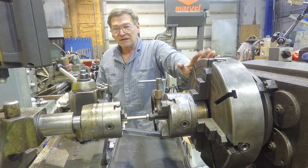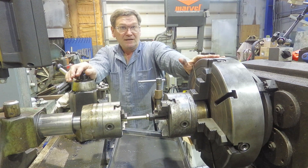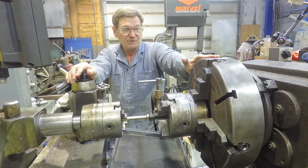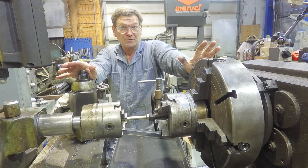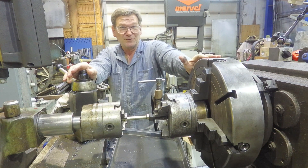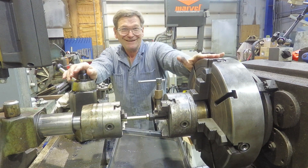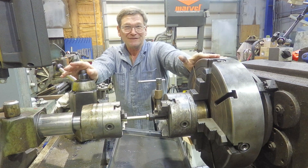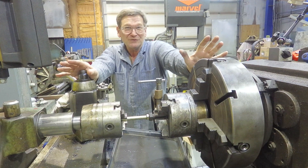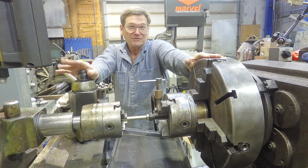I'll give an example from many years ago at another shop. We had a little job that paid about eight to ten thousand dollars, and the lathe we were using was pretty much a piece of junk we paid a thousand bucks for. The lathe was too small to do what we needed, so I took a disc grinder to part of it, cut some of the ways out, and made a very crude gap bed lathe. On the one hand, oh my gosh you ruined a lathe — on the other hand, I made seven thousand dollars for the company.